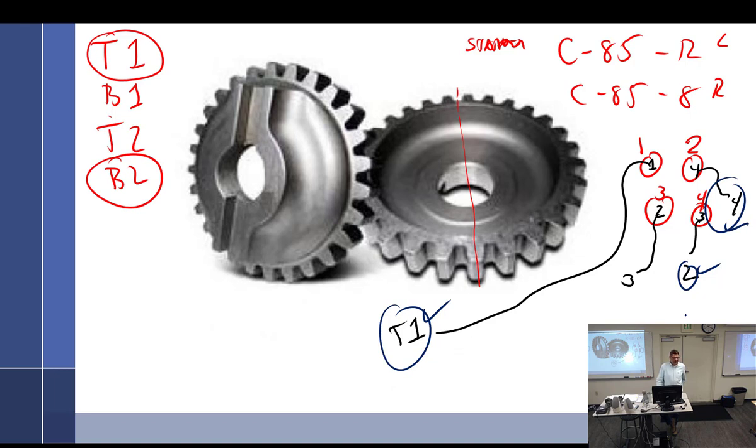What do you mean leads are going to the right cylinders? Yeah, we verified it like 6 times. The 1's going to the 1. The 2's going to the 2. I'm like, no. The differences are going to go different. So that means the 1 and the 2 are correct, but the 3 and the 4 are the wrong spots. Because you ordered the wrong part number harness.